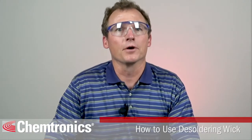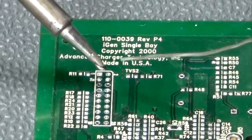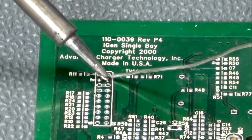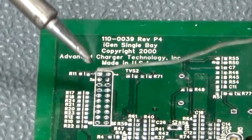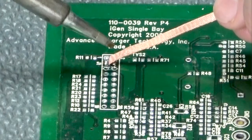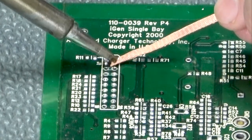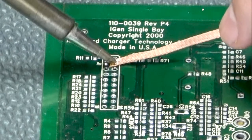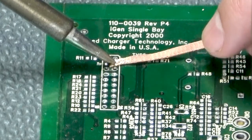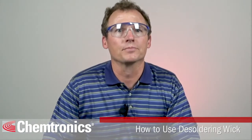Sometimes there is a small amount of solder that is difficult to melt. This happens occasionally when solder is left in a through-hole after removing the lead. Applying heat long enough to get down into the hole and melt the solder could damage the board. Instead, add a good amount of solder back to the area. Then put the wick over the solder and remove it the same way as previously described. The additional solder acts as a heat bridge to the tiny amount of solder that was hard to reach, so it is all absorbed at one time.